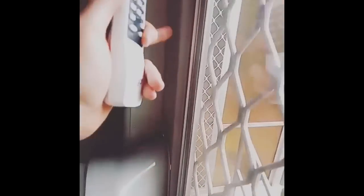I still need to put the seal down the sides for a snug fit. With my window I needed to add some foam to stop it from wobbling and potentially falling out because of the window size. I put foam along the top and bottom, and since this is a full-span screen window with no center bar and no locks, I've also added some styrofoam to stop it from sliding back and forth.